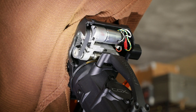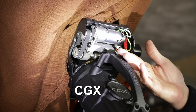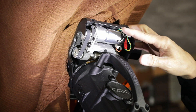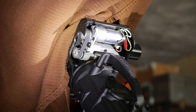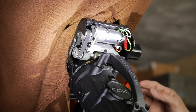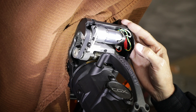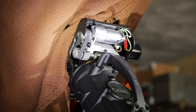Hello group, Jeff here. I have my CGXL with the deck servo motor cover removed — there are four screws. I'm going to show you how to set the backlash on the CGX or CGXL. It's the same thing; the CGXL is just a little bigger with bigger motors and bigger gears.